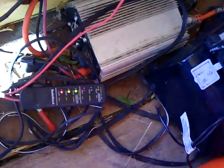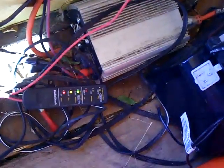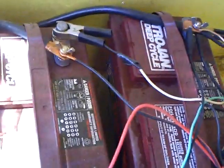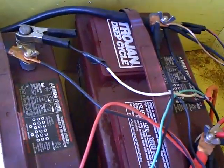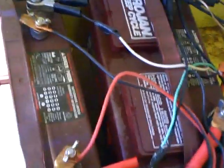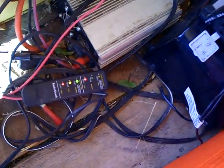The other unit there with the indicator lights is simply a power monitor. I think I paid $5 for it at Radio Shack. The lights on it are green right now, showing that my batteries are charged up. It's only noon, and in just four or five hours of sunlight my batteries are completely charged. I could add as many as four or five batteries to the system if I wanted, but two batteries is enough to get me through the night. The indicator lights also tell me as the battery drains down if I'm starting to get low on power, so I know to start switching things off or check if something has come loose.